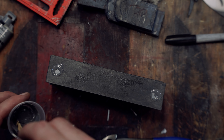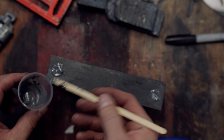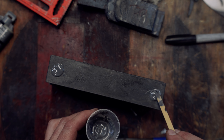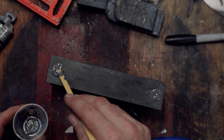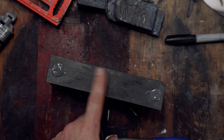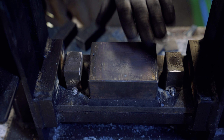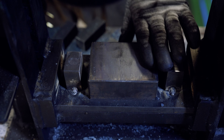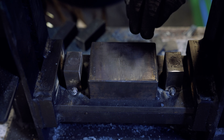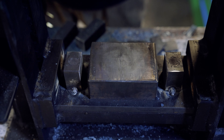You can use a drill press, no problem. I put some JB Weld in the holes and fill them completely because the holes are a little deeper than the magnets — I don't want the press smashing the magnets since it just breaks them and makes them less effective. This just has to cure up, and then I'm going to weld these to the plates. When I'm drawing out my Damascus and it gets thinner, the larger dies really don't do much except straighten things out, so I'm going with a thinner piece.